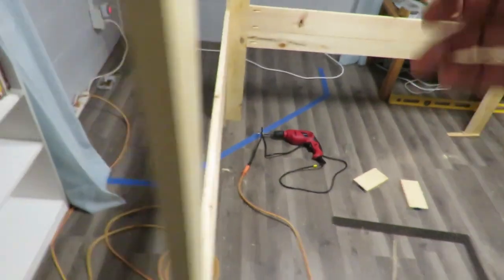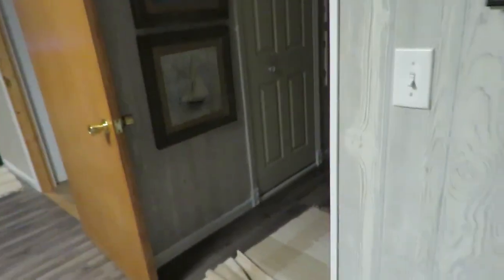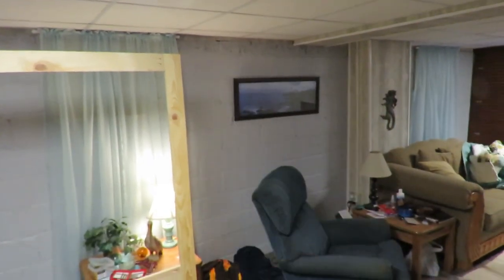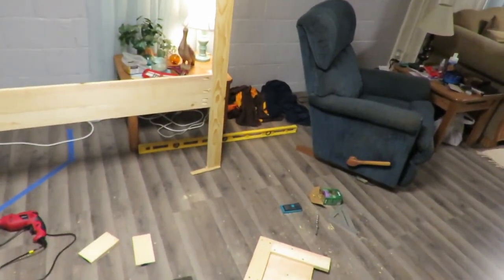I do have these two pieces put together. What I did was I had to shim up that side because my floor is not level. I ran a four-foot level on both sides to make sure it was perfectly level. Then I went down one inch and at one-foot intervals pre-drilled them and used Torx head finish screws — these are 8x2s. Now I need to start making the two-foot pieces on the ends that have the doors. There'll be a piece sticking out on that side with two doors, so I'm going to start working on those.